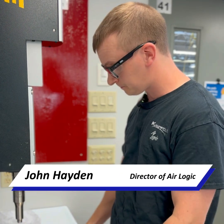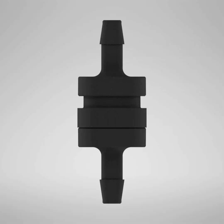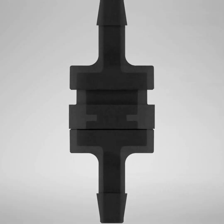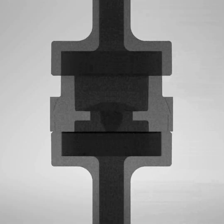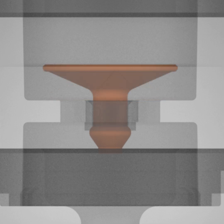What we've been making a lot lately is umbrella check valves. If you don't know how an umbrella check valve works, it's shaped like an umbrella of course, and then you apply pressure through some holes, and as that pressure increases the umbrella is going to lift up — just like a big umbrella in the wind — and your flow is going to go around it.